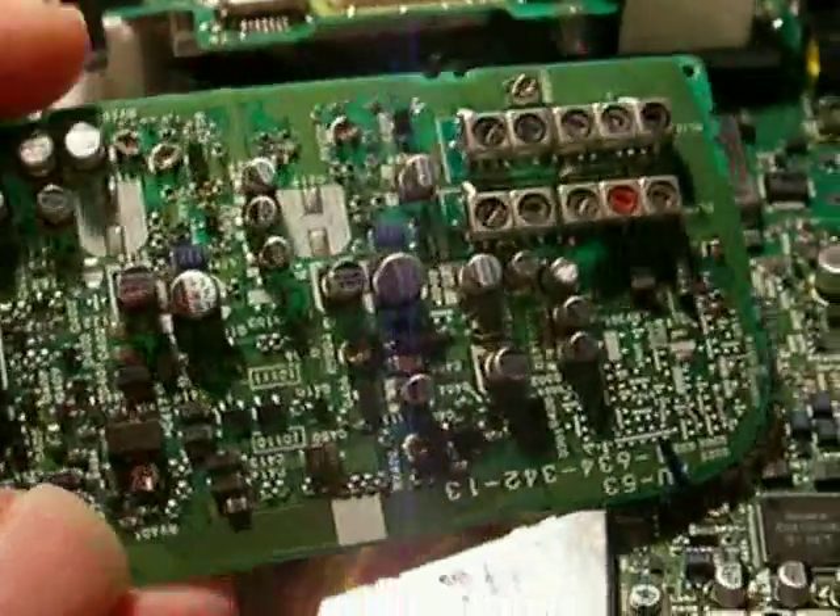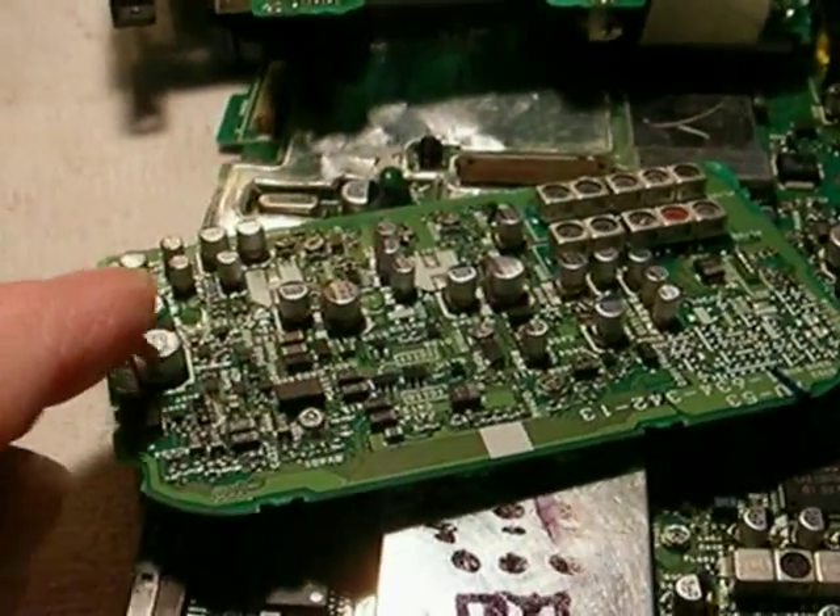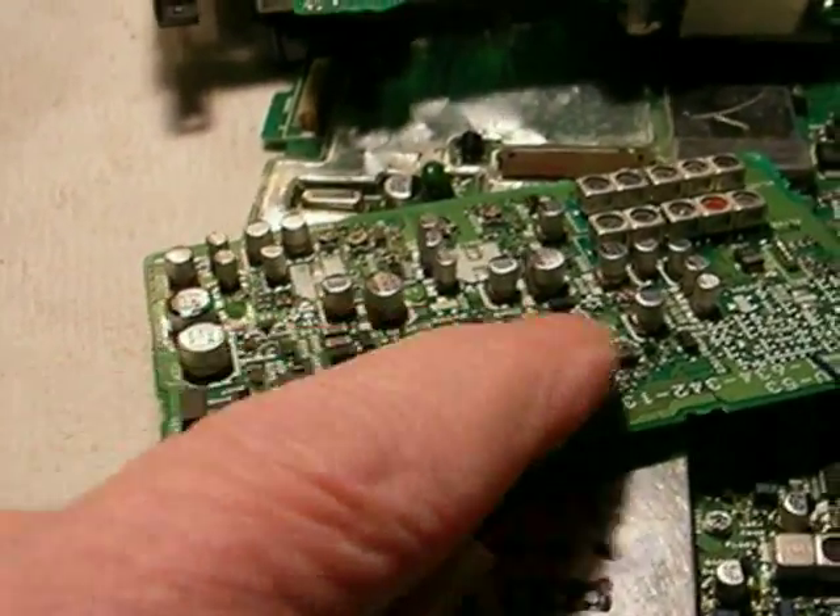That's the cosmetic issue. Electrically, it's another story. As you can see, there's a set of boards from one of these things — the tuner board is up in the lift-up lid area, and this is the LCD board, the color processing and chroma board. This is the audio board here. All of these little tiny surface mount electrolytics all have to be changed. They spill their guts.